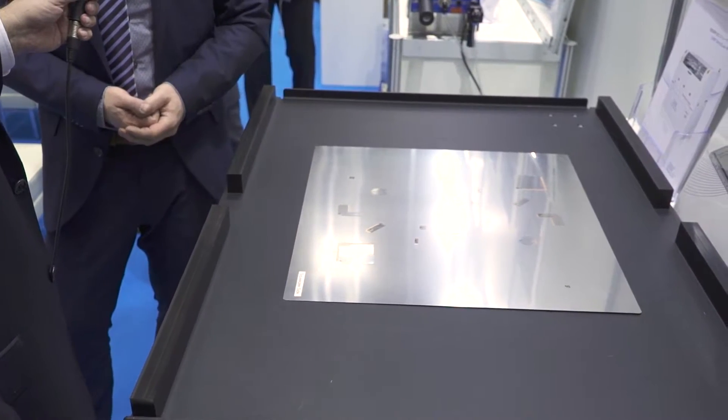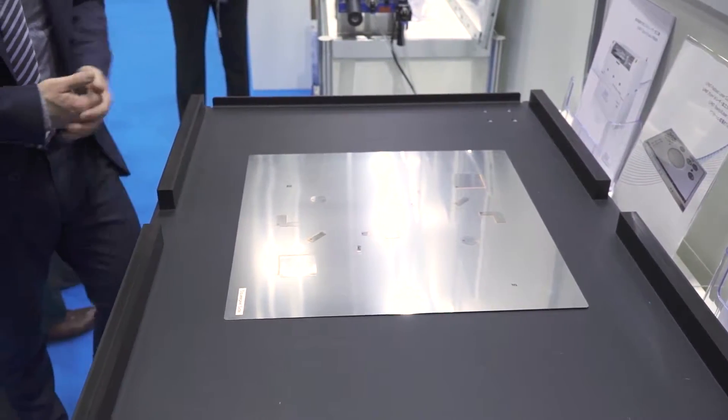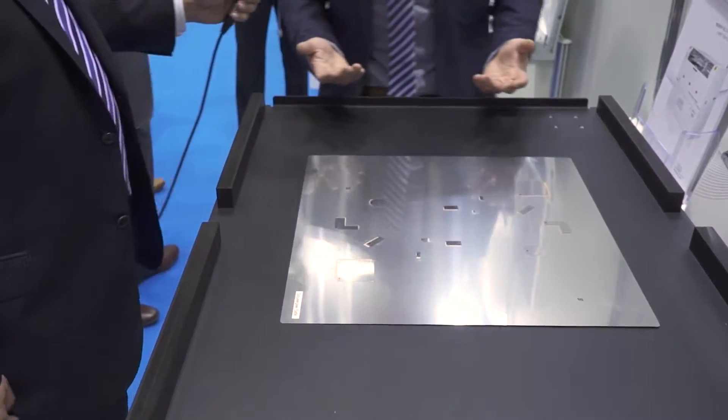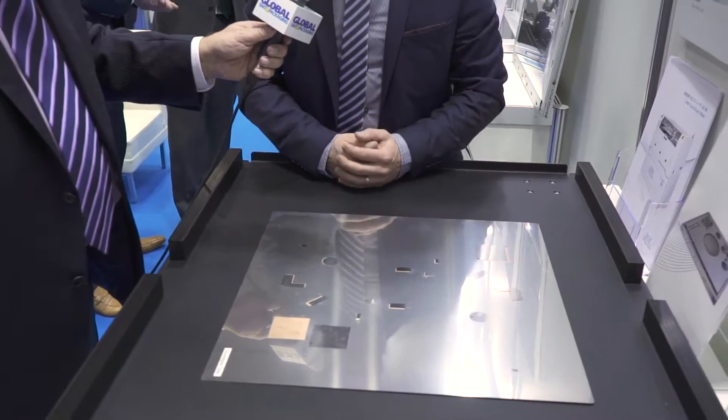You can combine step-up and step-down areas in one stencil, and how you do it is quite simple. First you start off with the base stencil. You take the material — it might be 120 micrometer thickness of standard stainless steel. Fine-grained material is also possible, so any stainless steel grade is basically possible. You take the base stencil material to the machine and you cut out the patches or the area of the step first.